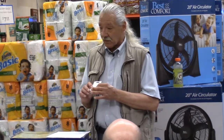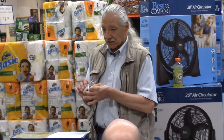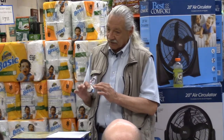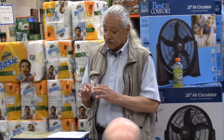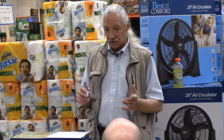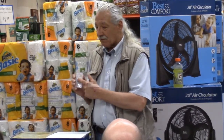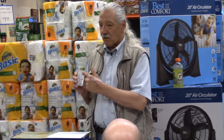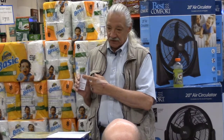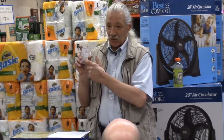All right. So there's two ways to go about that. Number one, with a paper clip, you can insert it into the hole and pull that wire out with the tin end. All right. Or if that doesn't work, just crush this switch with the pliers and take the wires out, and you'll save the tin ends. Before you do that, though, these switches have codes on them: L, 1, 2, and 3. L for the hot line, and then 1, 2, and 3 for the speeds. Mark those colors down with the numbers, because when you put them in, they have to correspond on the new switch.